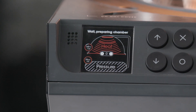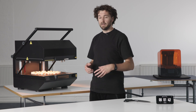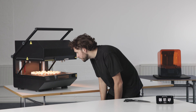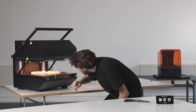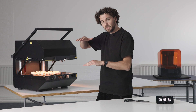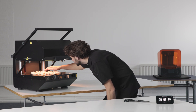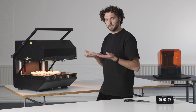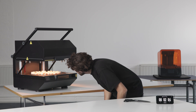We're using a profile that we've got saved for this. This profile is already installed on the machine, and you can make your own profiles and change all the settings. I'll go into a little bit more of that in a second. I'm also just going to press this up arrow to bring that sheet up a tiny bit above any of those models, just working with that auto leveling system because we're going to be covering quite a lot of models here.